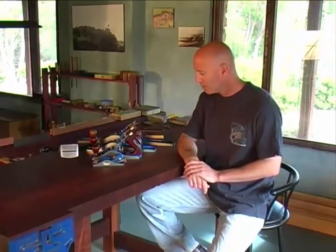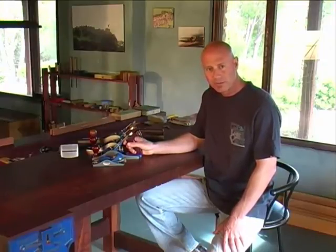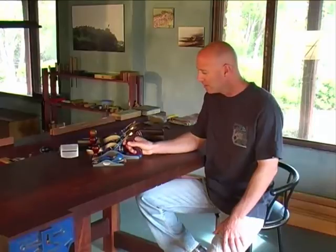You may also be thinking that if Scott is using the cheaper hand planes, how can he get the result he would surely get if he were using a more expensive hand plane — maybe one like a Lie-Nielsen or a Holtey? Well, certainly with a Lie-Nielsen or a Holtey, when you buy your hand plane and take it out of the box, it's ready to go. These ones do need a little bit of work, but if you're prepared to spend two or three hours on your hand plane to true it up, you will have it working as sweetly as any of those more expensive planes.